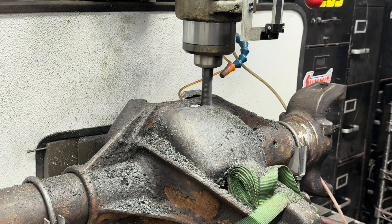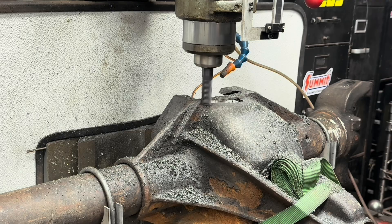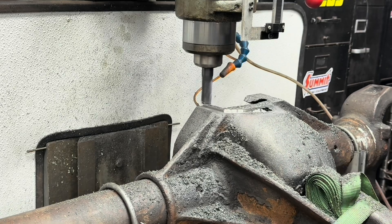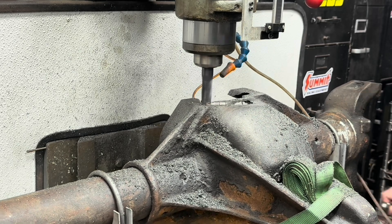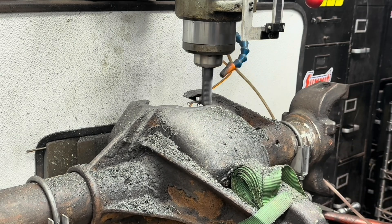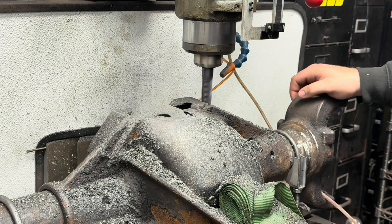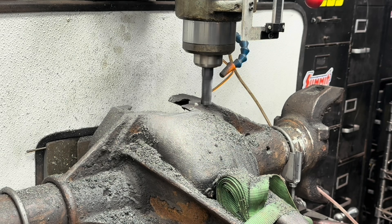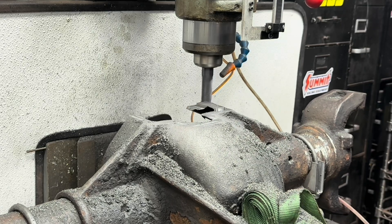I ended up going and welding it solid. I also forgot that we had machinist jacks, so I replaced that block of wood and plate with nice machinist jacks. As an improvement, my dad came around and we added a little bit of coolant spraying for when we were taking those heavier cuts. At this point we were done with the heavier cuts, so I turned the coolant off and we were cutting for final fitment. The way we did this was we measured out like they said, but we also just did test fitting — test fit, go down a little bit more, measure. I just didn't want to overshoot how much I needed to cut, so it was slow going, but we wanted it perfect, and I'm very happy with how it came out.